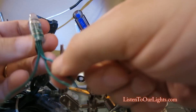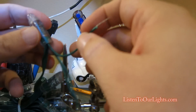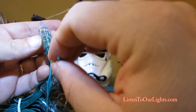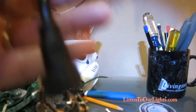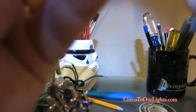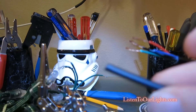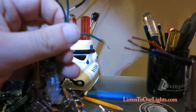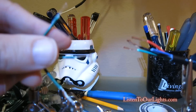I need to figure out what goes with what, and I do this by looking through the epoxy — I can see that this one is 12 volt, and this one on the end is also 12 volt because I can see through the epoxy. Before you start twisting things together you want to get your heat shrink on here. This big one is going to go over everything. I need some of the smaller ones too — this is heat shrink, and when we apply heat from the heat gun it will shrink and give us a nice covering over our joints so they don't touch and short each other out and ruin the lights.